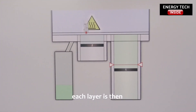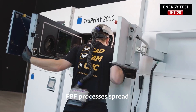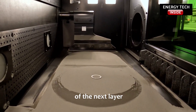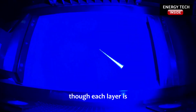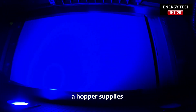Each layer is then sequentially bonded on top of each other. PBF processes spread powdered material over the previously joined layer, ready for processing of the next layer. Hence, the manufacturing is discrete rather than continuous, though each layer is fully consolidated to adjacent layers.